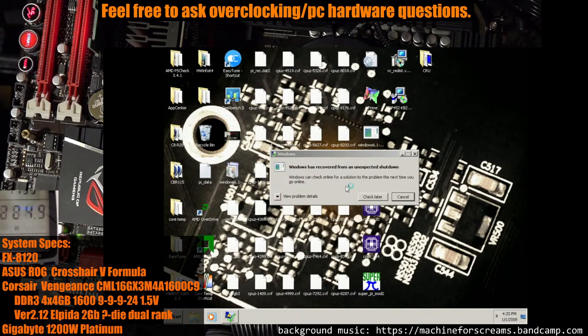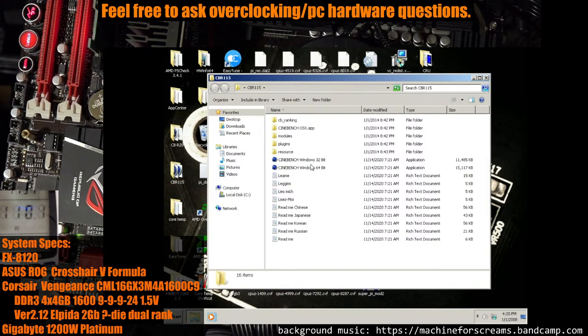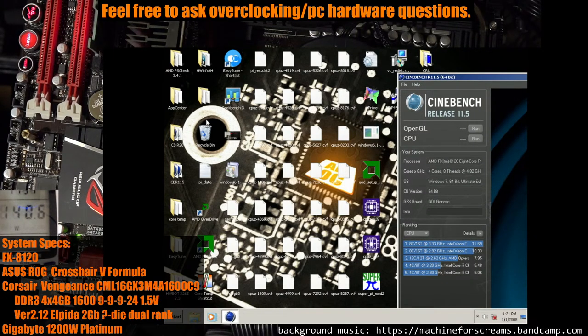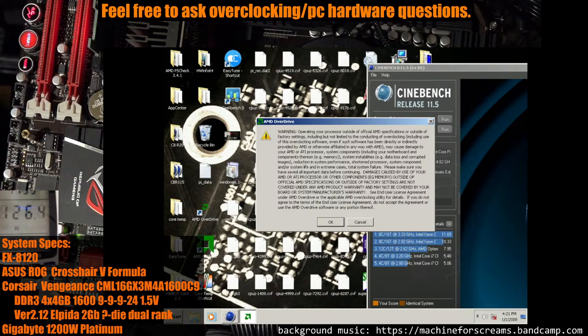Oh yeah, Gigabyte had a 990 FX board with an M.2 slot. There's a version of the UD3 with an M.2 slot. There's so many versions of the UD3. The initial versions where the VRM likes to explode, the later versions where the VRM just turns off after they implemented overcurrent protection. What's crazy to me about the UD3 is that it uses a 4-layer PCB. In fact, as far as I know, the only motherboards on AM3 Plus that are 8 layers are the Crosshairs. Everything else is 6 or less, which basically means the vast majority of AM3 Plus boards are 4-layer PCBs. Probably part of why the boards run so damn hot. Actually, maybe Asus have more 6 layers. Like, Sabertooth is probably a 6, might be an 8. I don't know. I do want to check Overdrive this time.